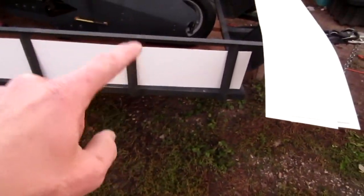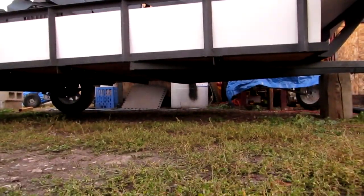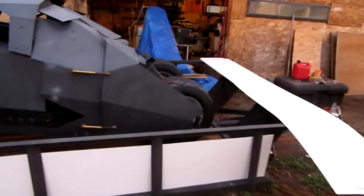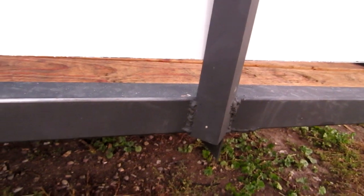These gaps are exactly 12 inches and I cut these at 11 inches. What I'll be doing is lifting this up and covering down there, leaving a kind of a gap so I'll be able to run my ties through there and hook them underneath the angle iron right there.